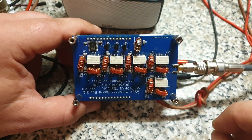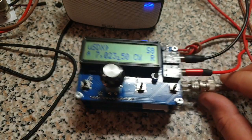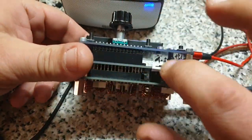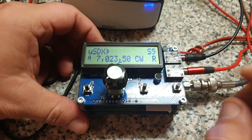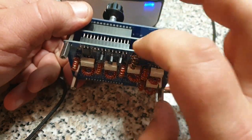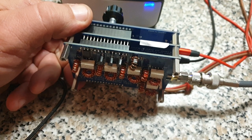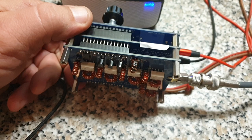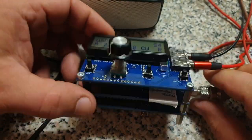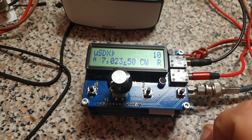Parts are easier to get. In the last video I presented my shopping list and how to buy it. Now, there have not been only improvements in hardware. By the way, I changed the main board - I exchanged it to a four-layer board, which made it RF-wise a little bit more stable. From an RF-designing perspective it seemed a little bit better. Even though I did not see much difference between two-layer and four-layer boards, I just did it because they are cheap anyway - about one to two bucks per PCB difference when buying from China.